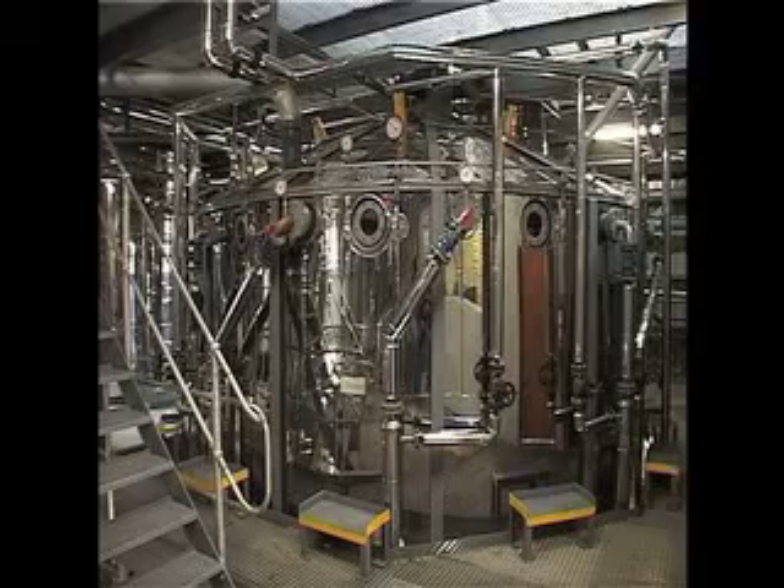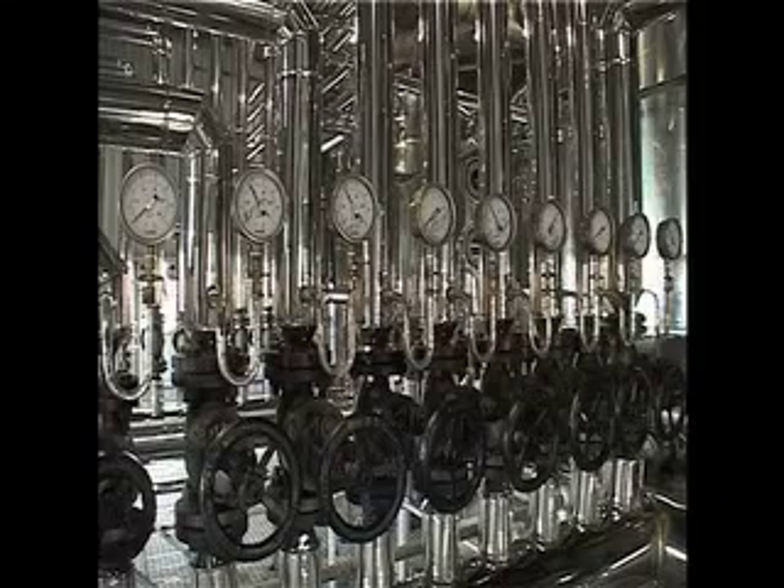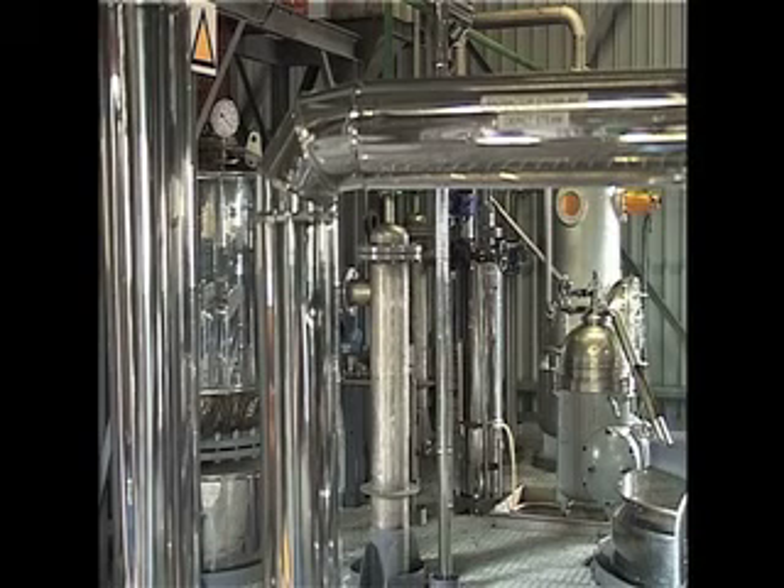In the pressing plant we mentioned the oil cake, which is still rich in oil, and is fed via a conveyor into the extractor. The purpose of the extractor is to extract the oil with a chemical called hexane. Hexane is pumped on top of the oil cake, it extracts the oil out of the cake, which is then run into two settling tanks.